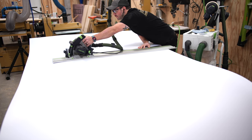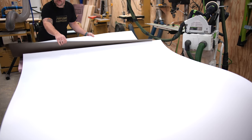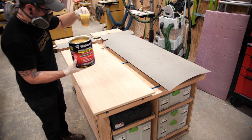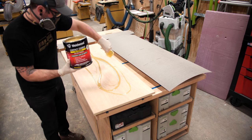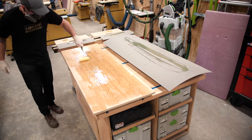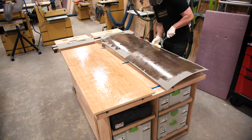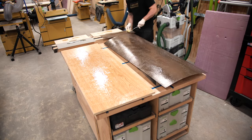I decided to try my hand at adding some laminate to a few of the drawer fronts as well as the door, and I picked up a 5x10 sheet of white laminate from a local countertop manufacturer for about $100. After cutting pieces to rough size with the track saw, I adhered the laminate to the plywood using contact cement. I used Weldwood contact cement, but this stuff had god-awful fumes and left my shop smelling terrible for a day or two. I'd recommend finding a water-based contact cement if you're doing this in your shop — I'll link to one from Wilson Art in the description.